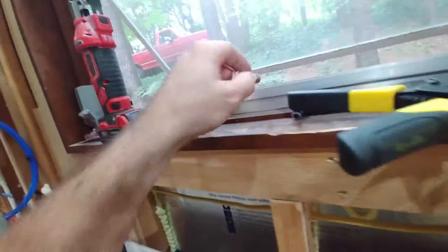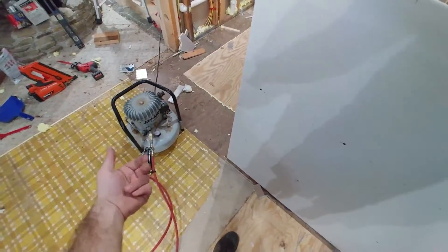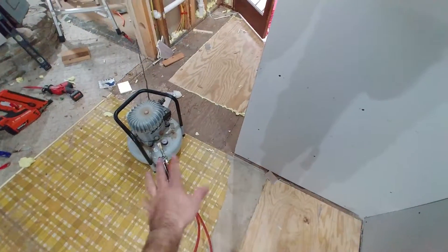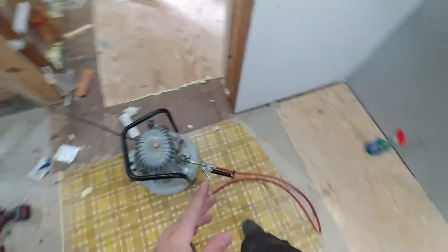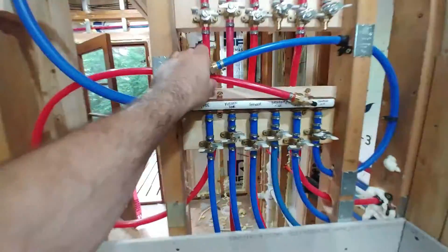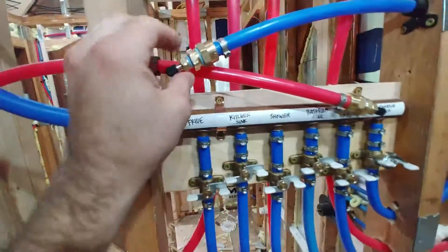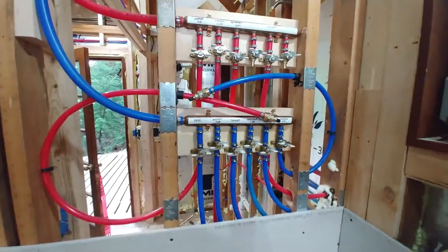I did have air tool connections on here before today, but I determined that being able to use a nice filler like this is better. There are some that have a pistol grip and a dial which offer a bit finer accuracy. The key is you can note the needle position and come back in a few hours to see if it's dropped. That's essentially the whole process: how to set this up, how much PSI to put in, how to leave it, and using soapy water to check for slow leaks.